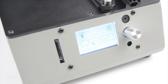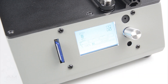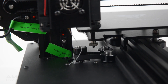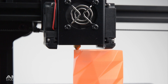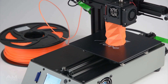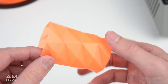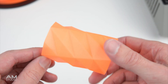The next step is to select pre-heat from the menu and insert the SD card with the pre-sliced file. Once the printer reaches temperature, hold the lever on the extruder and feed the filament until it reaches the nozzle. Select the file and begin the print. The first print is a vase printed in PLA, straight onto the print bed surface. Without a heated bed the print still managed to hold in place, although it was only just attached by the end of the print. The quality of the final item was super smooth with no visible defects or issues.